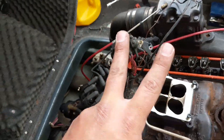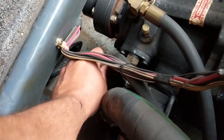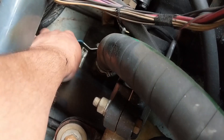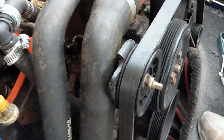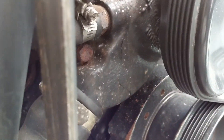Two problems found so far: when Genius Mike first arrived, this valve was off — that's a big deal because that's what was pulling water in from the lake. The next thing is this hose — it doesn't seem super important, it looks like an extra fitting, but there's a definite kink right there.